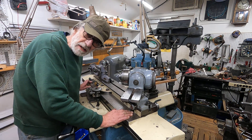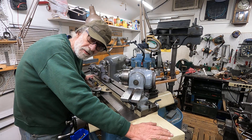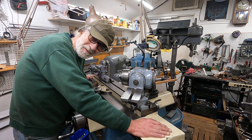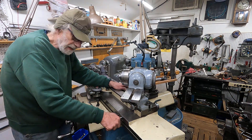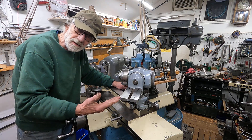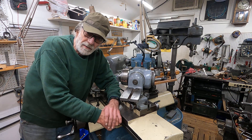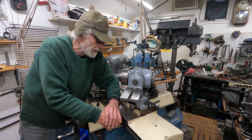If you move this machine as it's sitting, you can damage it because the table probably weighs about 300 pounds and it's going to start bouncing on top of this. So you've either got to move the table — remove it, which is best. It takes two strong guys: you take the top off, pull the pins, and lift it off. But if you can't do that, you can take some hardwood wedges and drive them in here to lift the table up off the bearings. And there's the problem: if you see a machine for sale for $140, what if those table tracks are damaged? That's going to really cost you if you can get it fixed at all these days. Best to find another machine.